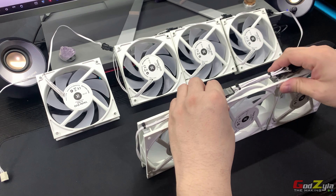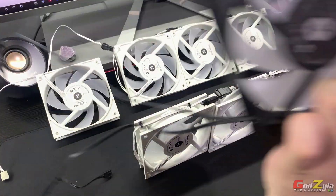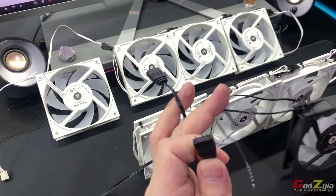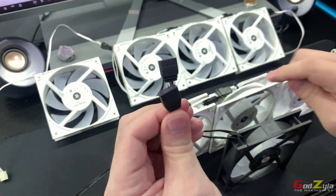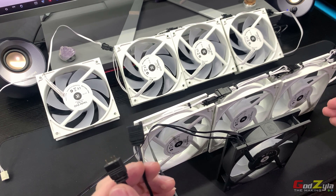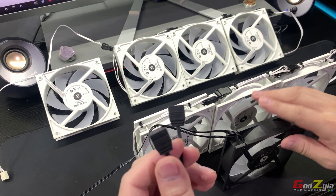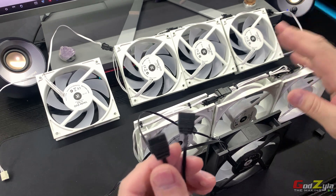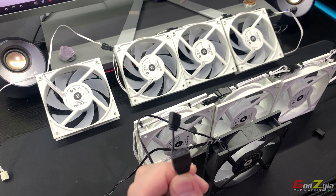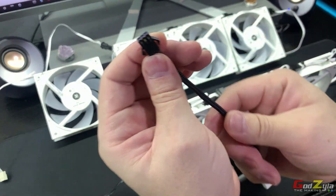For those who don't know how to do crimping, don't worry — there is another way. If you purchase any fans that come with a daisy-chain ARGB connector, like this EK Verda here, you can use that. Do take note: not all ARGB fans can be used — make sure you know the LED power draw. As long as it's below 0.65 ampere, you'll be safe. This one is 0.14; the black version is 0.2, but still safe. The normal ARGB cable just needs a converter from a standard ARGB connection to a JST-03 female connector.